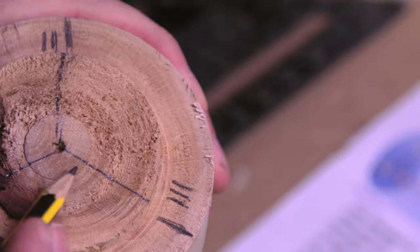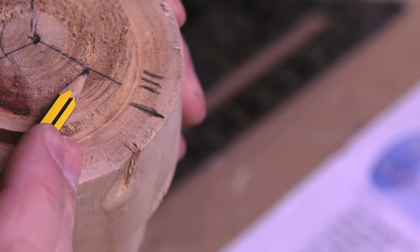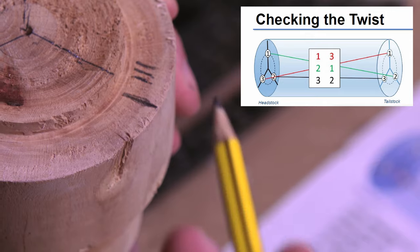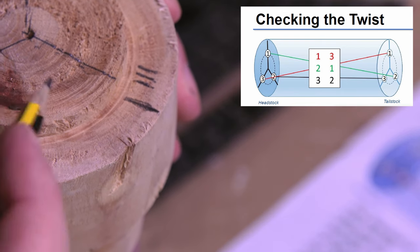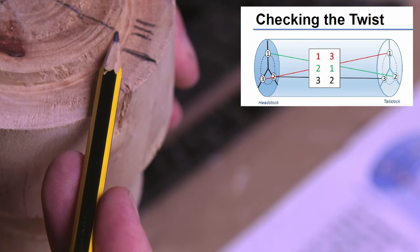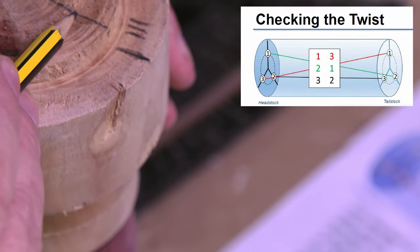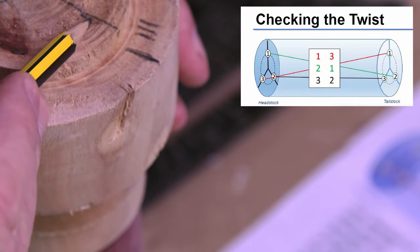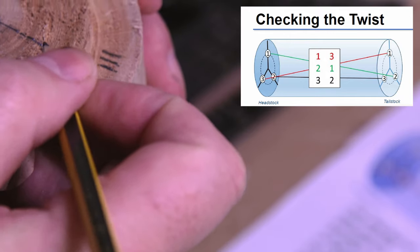Now what we need to do is work out how far out the mark is going to be. When we do this, we need to bear in mind that the headstock four-spur is going to need something to grab hold of at quite an angle — this is where the spiral comes in. We mount tailstock to headstock on opposite numbers, and the distance from the centre to the outside of the piece — the diameter in the middle of the sacrificial wood — will determine how spiralled or how acute the spiral is. If you have it right out here, you'll get quite a significant cut in the spiral; closer to the middle, you'll get less of a spiral, but a spiral nevertheless. It's kind of guesswork at the moment.